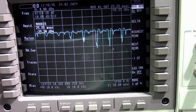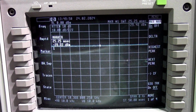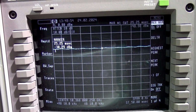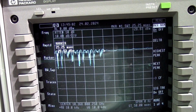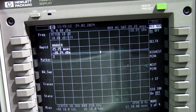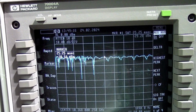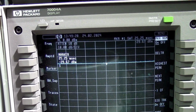Notice the diamond on the screen in the center at the same height as the signal. Now you can see it. Okay, so it indicates the power. Look at on the left, we're at -29, which is a little bit more than 1 watt unmodulated if I don't speak. So it means there's a little bit of headroom because you're gonna see when I go in Charlie Whiskey in CW, you'll see that there's more power coming out.